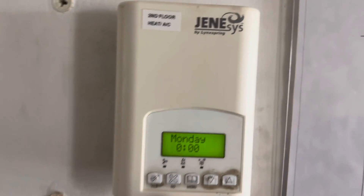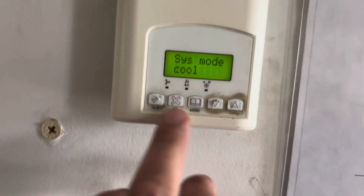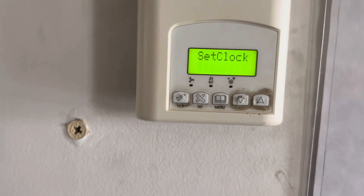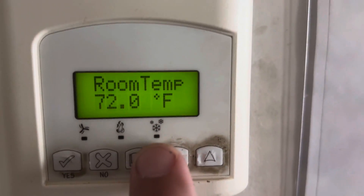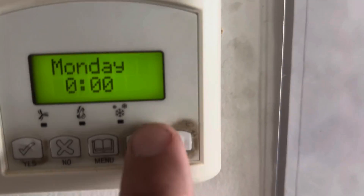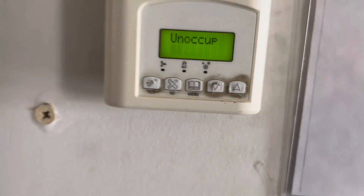There's some sort of roof access here so we're going to go around and see what's going on. This is the thermostat that's downstairs, and this is the upstairs one. It's kind of weird — there's nothing that really tells you if it's going into cooling, but these lights here: if this one is lit up and this one is lit up, the air conditioning should be running. That's fan and then air conditioning, and both those lights were lit up, so we've got an issue up on the roof.